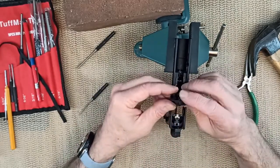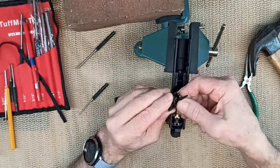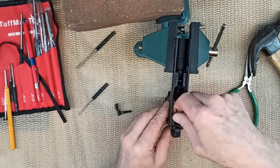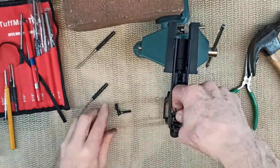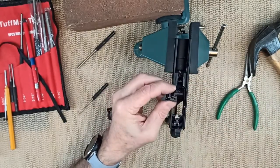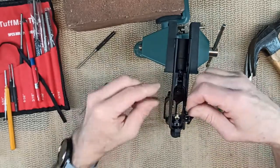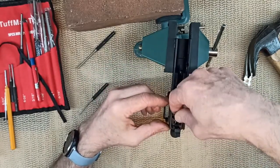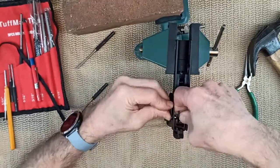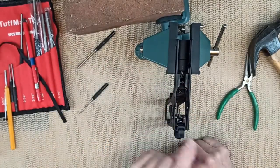And then on the sear, you can try to put it in. It's going to be a nightmare until you push on the sear during insertion and all the holes are going to match. And that's when you put your safety in. So push on that sear. Oh, my mistake. Don't forget that spring here. It needs to go up. There we go, for the safety pin to go through. So push the sear down, insert. All the holes will be matching. Yep, and that's it. It's almost at the end, except that little pin is holding the safety from going through.